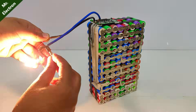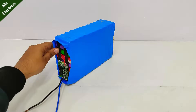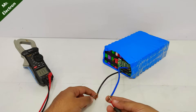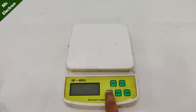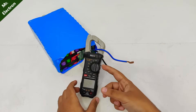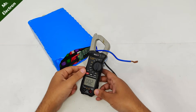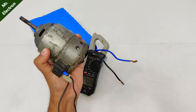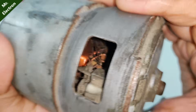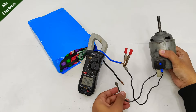The BMS connection to the battery pack is finally complete. Let's connect this 55 watts bulb and test it — it works! I've finally completed my battery pack, so now it's time to conduct its full testing. Starting with the voltage test — here we have 11.71 volts DC. Now let's do the weight measurement — here we have 4.2 kg. I've placed the clamp meter to the blue positive wire, and I'll switch it to DC current measurement mode.